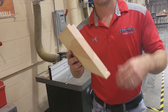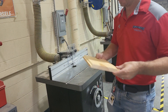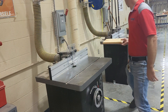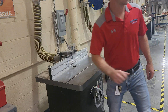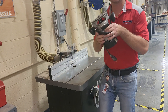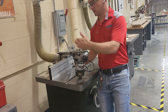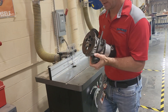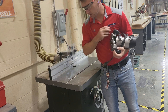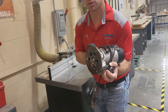I ran that one twice because I didn't get all the way down — it was a little lighter on one side. That was a rabbiting bit, so I got a rabbet here and a dado right here — two different cuts we can make on this router pretty easily. I keep calling it a router because it's the same kind of setup. Sometimes these are mounted in tables and used the same way with a fence. This handheld router uses the same type of bits — this one's got a round over. We'd use it to round the edge of a larger project like a tabletop.